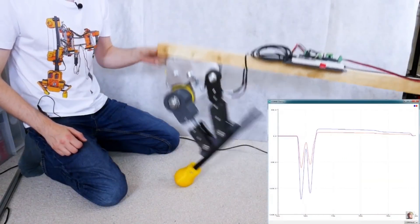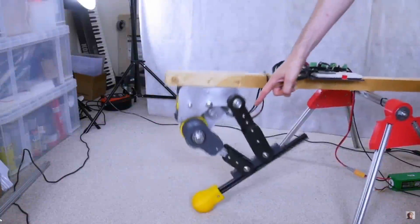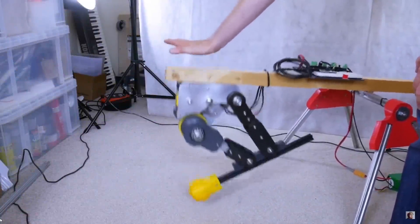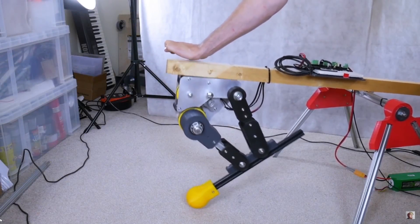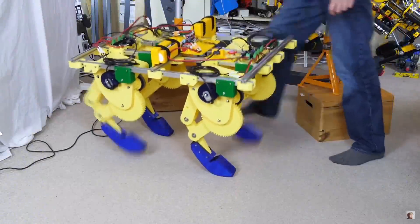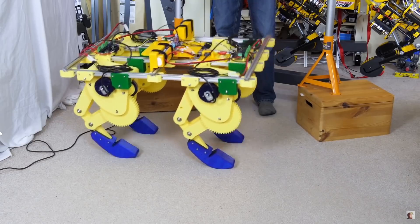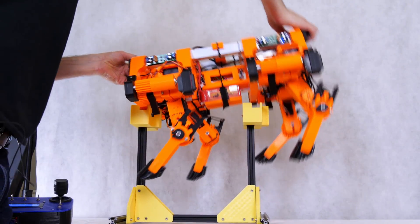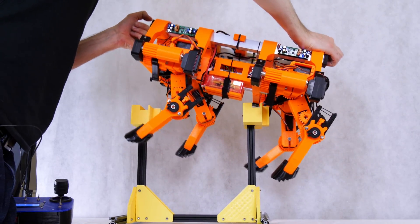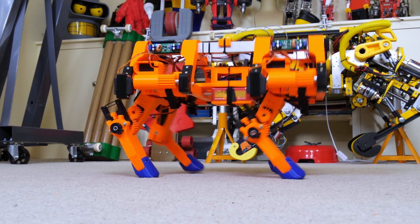I did quite a bit of testing in the past with some test legs and robots specifically to work on solving this issue. This involved a hacky dynamic force-controlled system which looked at where the joints should be, where they actually are, and used the difference as a force reading. I then drove the joints to a varying position toward the direction the force was being exerted to absorb the load. This happened dynamically based on inertial measurement unit data with an IMU in the robot's body, which helped to level out the robot, making legs on one side softer than the other as it tipped over. In my mini dog version 2 series I used IMU data to alter the translation axis of the robot so the feet moved in the direction the robot was tilting, which helped it balance on two legs and walk more slowly.